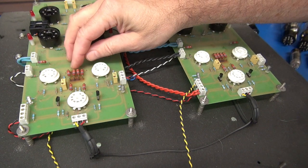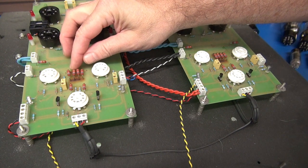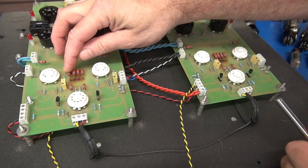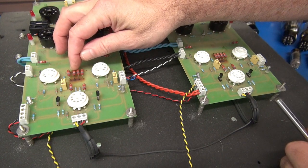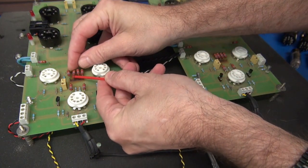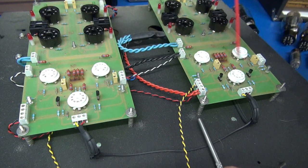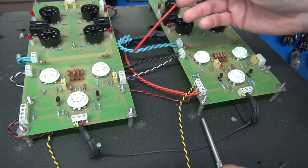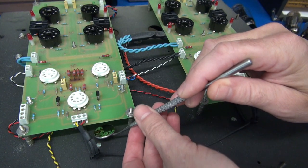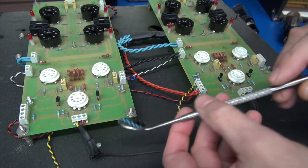When I see this evidence of heat damage, first thing I do is just see if the components will rock. See that lead there? She's moving in the solder connection. This one, you can actually see that resistor's loose. So more than likely that's what's killing the filaments to both of these tubes. It was just a coincidence that this problem happened after he moved it. Taking an inspection mirror and looking underneath, I can see all those connections are gray and pitted.